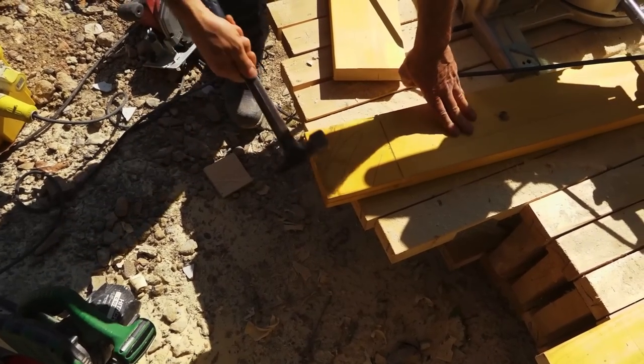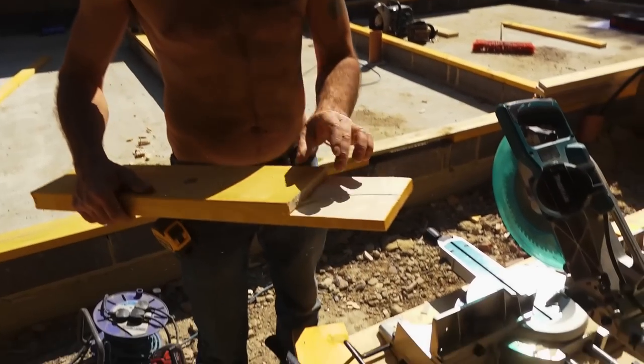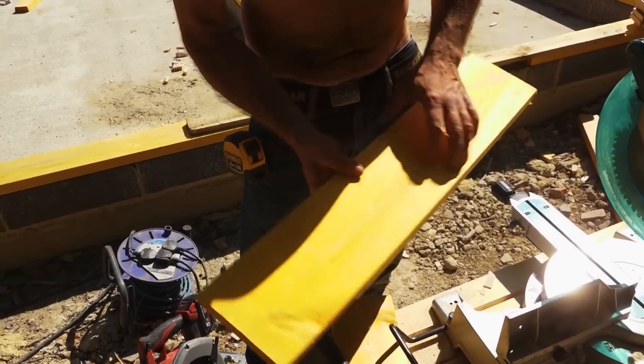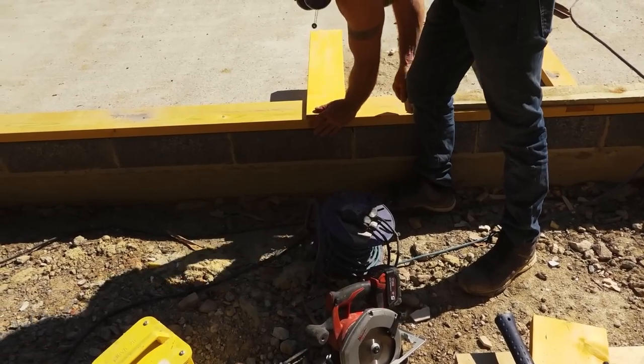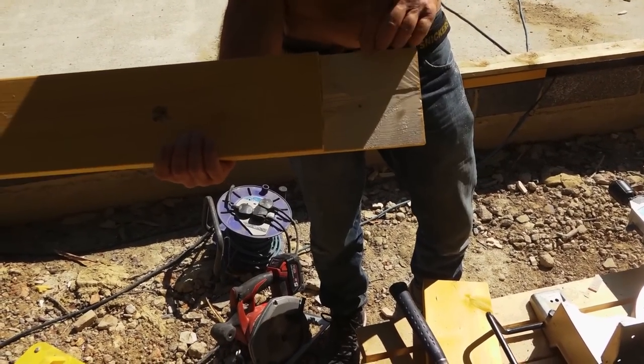Take the hammer, then give it a quick cleanup with a chisel. Best not to do too much overcut — though you can, because all this is doing is just going on top of there, not spanning over anything. You could overcut it a bit, but I like to just clean it out with a chisel for the last little bit.